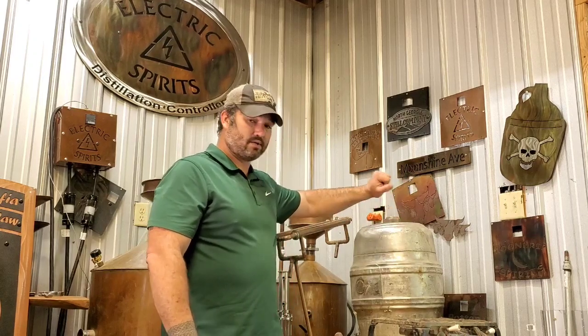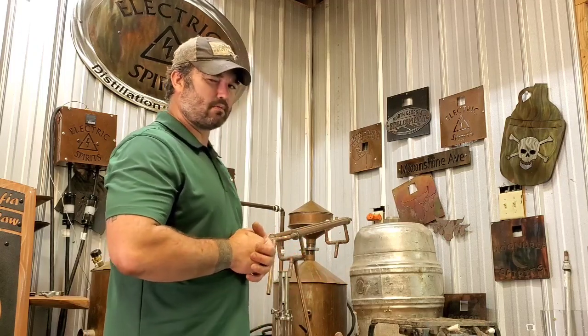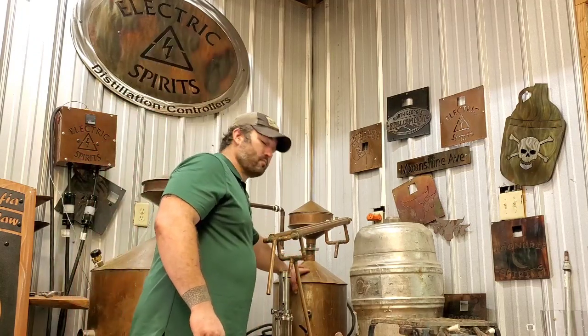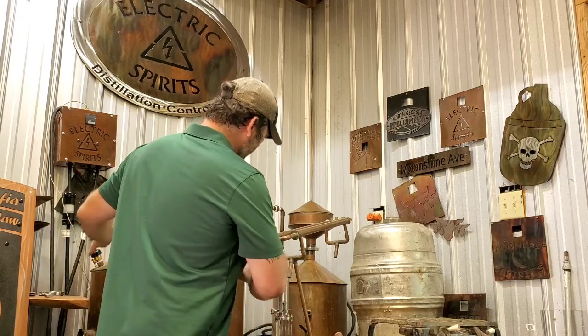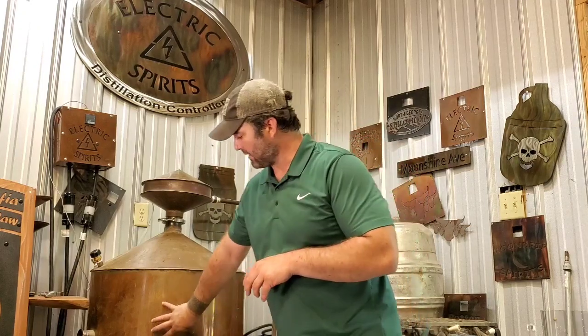You can also take a stainless steel beer keg — this is one from about 15 years ago that I built. I'm going to be doing a whole other series on taking a stainless steel keg and turning it into a still — efficient and relatively inexpensive, cheaper than your big copper pot. The main thing is it needs to be vapor-tight and liquid-tight, withstand the heat, and hold the vapor to concentrate the alcoholic liquid.